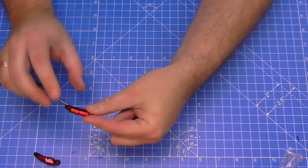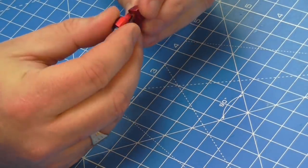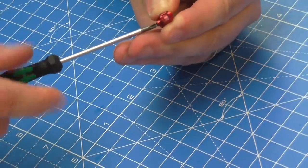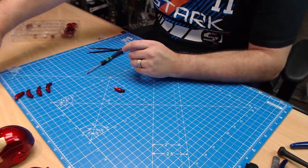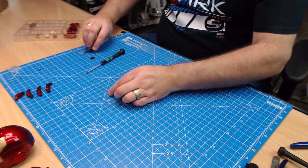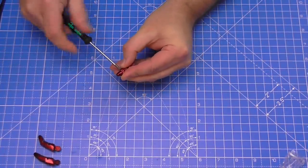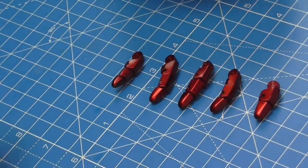Just to confuse you, the screw holes are on the other side here. You want to do them tight enough so it can articulate but doesn't flop around. One more finger to do - putting them in order so I don't lose track. Make sure it's in the right way, and we're going to be putting a CP screw through the base. But this time on the end, rather than an FP screw, we're going to be using a DP screw, which is slightly smaller because this finger is smaller. There we go - that's one, two, three, four fingers and a thumb.